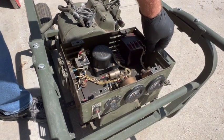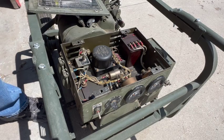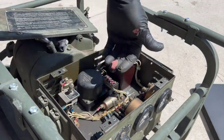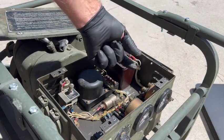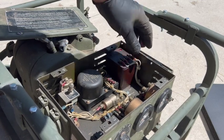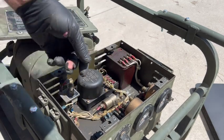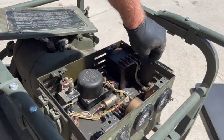Notice this box is a little bit loose. Let me see if I can fix that. That actually took a little while — the screw that needed to be tightened down was stripped out with a nut below it, so I had to drill that out. There's also a rubber bushing below it, sort of a shock absorber motor mount kind of deal, and it had been squished over time. So I had to put a new screw and nut in there and also a couple of rubber o-rings on top of the bushing to make up that space. But she's good and snug now.